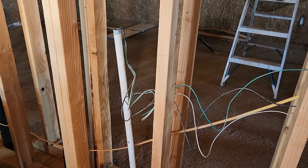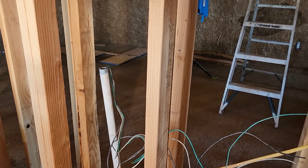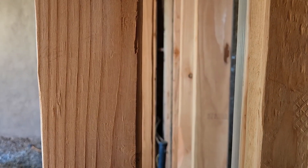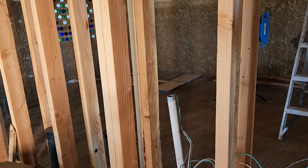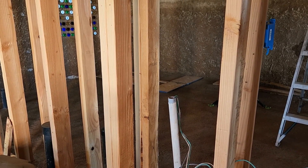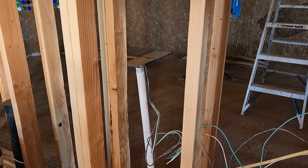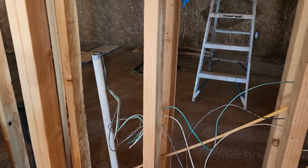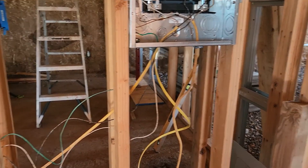We have a friend who's going to donate a significant amount of heavier gauge electrical wiring, and we'll get that all redone. Don knows the wiring we're getting is too heavy a gauge to pull through the existing underground conduit, so we're going to come through a different route — from the powerhouse where all the solar equipment is, down the wall where our other water lines and power lines are coming in. For right now as a temporary measure, this is keeping us in power so we don't have to run extension cords to the powerhouse or a noisy generator.